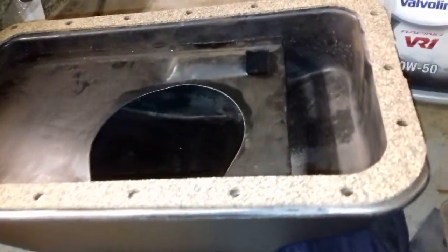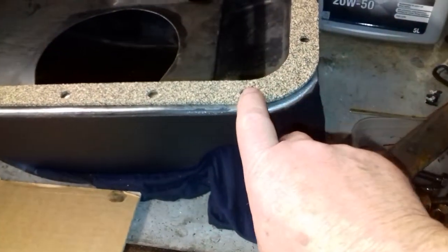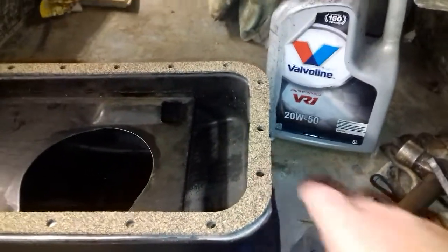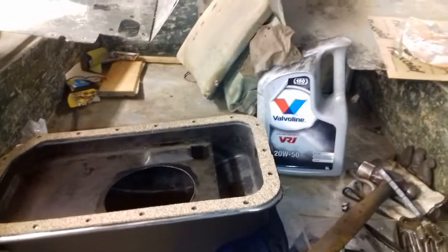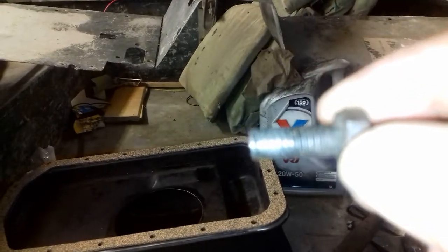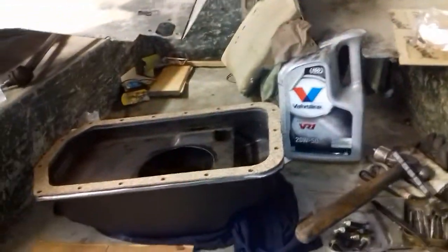I had a couple of issues with the sump. Apart from it being full of muck, slurry and sludge, it's all nice and clean now. There are these two bolts here — the rest of them are studs, 5/16th BSF studs, apart from this one and that one. I looked in the catalogue and it does call out for stud bolts. One of the bolts that came out has actually pulled a little bit of the thread out. The thread is actually Whitworth — I've checked it all out.